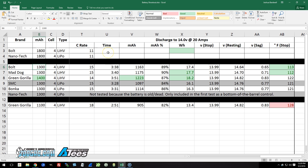We'll throw those results out and keep testing these 1800s going forward. I am charging the high volts to 4.35 volts per cell — some people wondered about that. If you charge a high volt to 4.2, that's not going to really show anything. And if you look at the milliamp hours, you can see that all of the high volts delivered far more milliamp hours than the standard lipos, as you would expect.